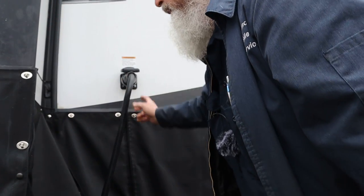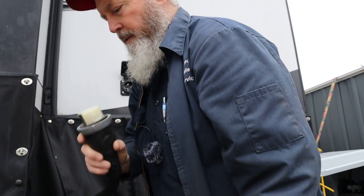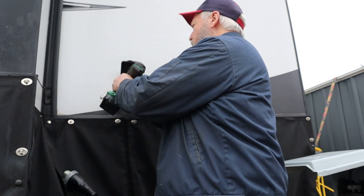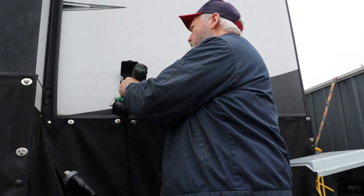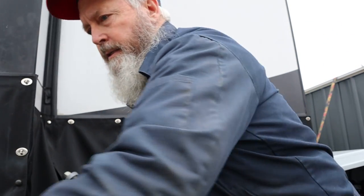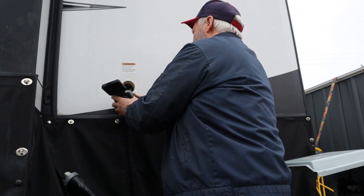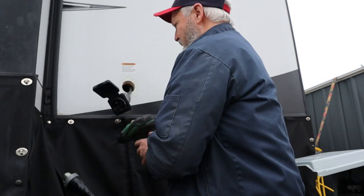We'll have to kill the power on this pedestal to do that. Before we call the campground owner, I look up and see that this is a detachable shore cord - let's look at this end of the shore cord. Everything looks awesome in there too. Both ends look good. This part of the shore cord that attaches to the camper has a rubber gasket on it, so let's pull it off and look at the connections behind it as well. There's a pretty big chance of rain today, so if this didn't have a rubber gasket I'd be a little less reluctant to pull it off - it might be hard to get it sealed back again if it starts raining.